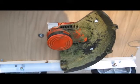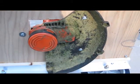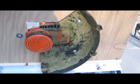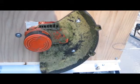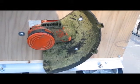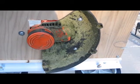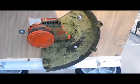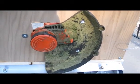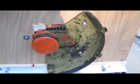What I want to show you here is I have 3 attachment points, and of course the grass guard is not removed. One reason I decided not to remove it, in addition to the fact that it made it easier to find some way to attach it, is that in the instructions for this trimmer they specifically say not to remove it because it could cause some problems with heating. And I see there are some vents on the bottom, and of course some vents on the top, probably for airflow. So that was another reason that I decided just to work with what I had and try to find some way to bolt this whole thing onto the plywood platform.